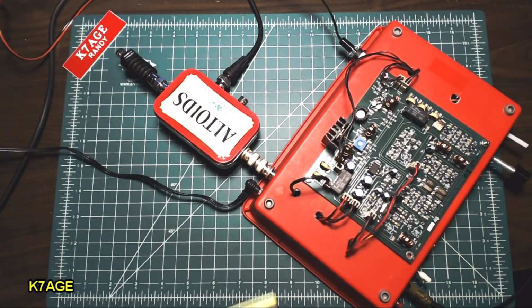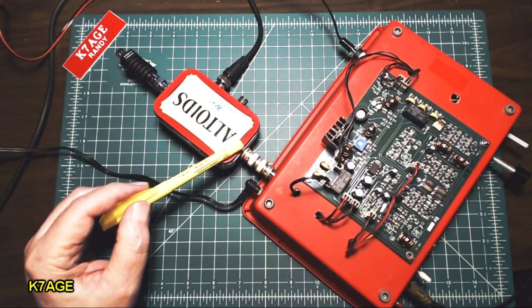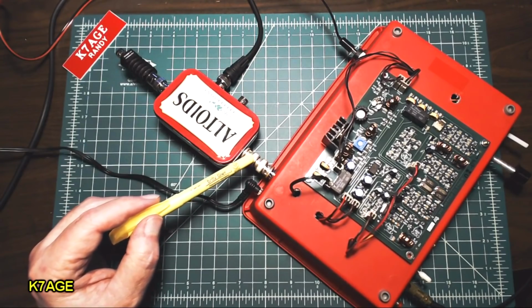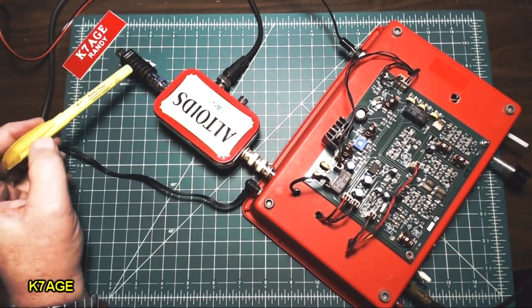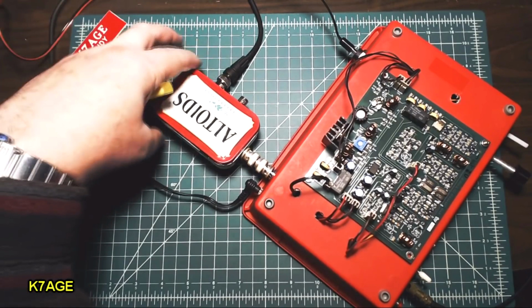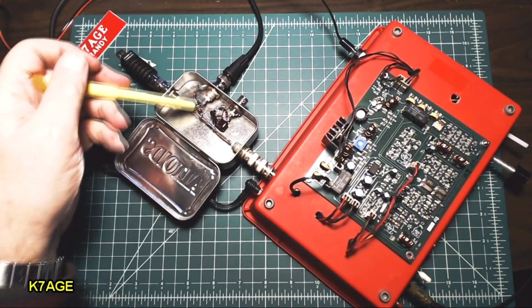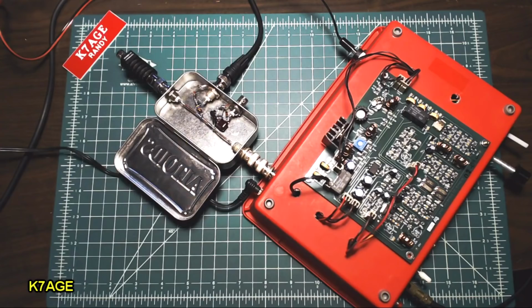Okay, let's give this a try out and see how it works. I have my BitX40, power connected here, speaker here. Here's the RF sampler box. With the connectors on the end, it allows me just to use a male-to-male BNC adapter, so I can hook it right onto the radio. And on this end, I have a 5-watt, 50-ohm dummy load. And this port here, or that output there, is just the resistor tap off of the RF. And of course, the other one has the diode.